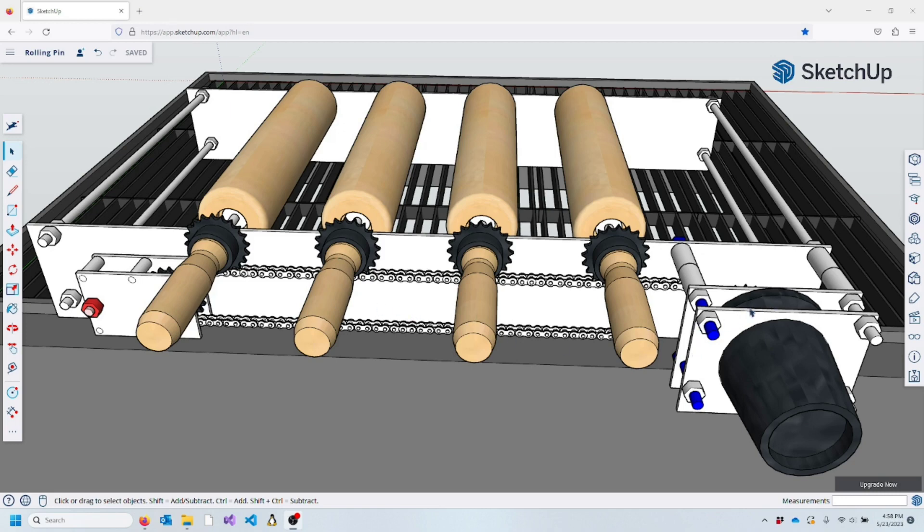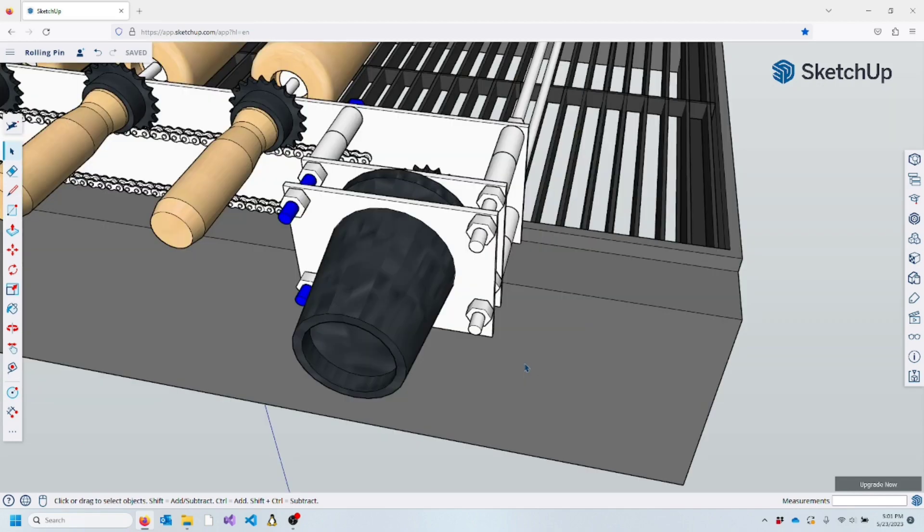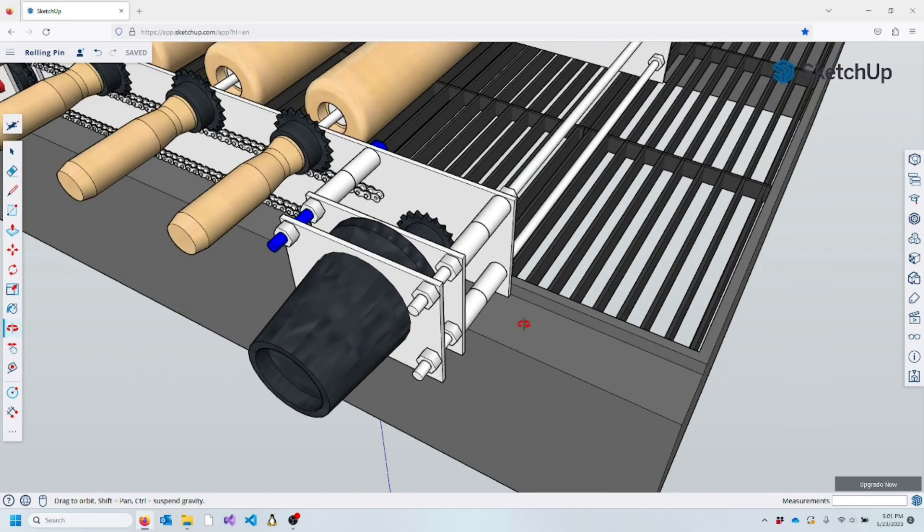To make the chain rotate, we have a rotisserie motor over here that turns slowly. I'll put in the comments where I got the motor — it's from Amazon, just a regular rotisserie motor. On the other side is a chain tensioning device consisting of a gear that provides the other pivot for the chain to wrap around. I found the most cost-effective way to make the rollers was to buy regular kitchen rolling pin rollers on Amazon and disassemble them.